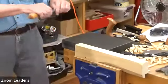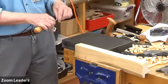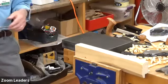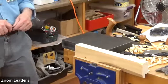Hey, Tim, can you give us some sense of how, when you're burnishing, how hard do you push? And how many passes are you making? Try 3 or 4 straight, and then 3 or 4 at 3 degrees, and then 3 or 4 more at 5, 6, 7 degrees, and see how that goes. In the past, I've done it too far, so you think, oh, I got a good strong blade there, but the bigger it is, the weaker it is. So that's not really where you want to go.